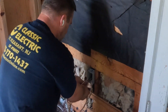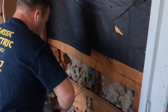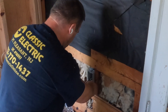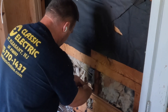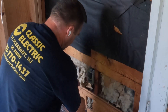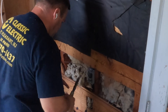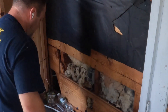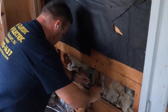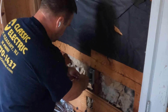And then from the edge of the box, we need to have a minimum of six inches outside the box — that's what the code calls for. So I'll pull the sheathing back, and then I'll take my equipment grounding conductors, the bare conductors, and I will wrap them together as you'll see here. Then I will leave one conductor longer than the other and splice that together in a loop. I'm wrapping these wires around, then I'll take one of the wires and cut it off, bend the long conductor and wrap it around again and splice it so it's nice and tight — that pigtail right there. Now you can put a green wire nut on this if you wanted to, I just didn't happen to have any in my pocket.